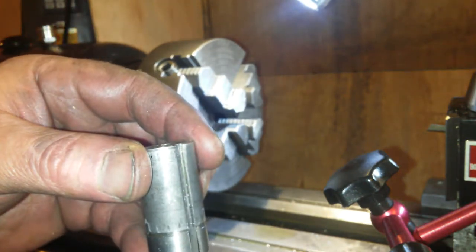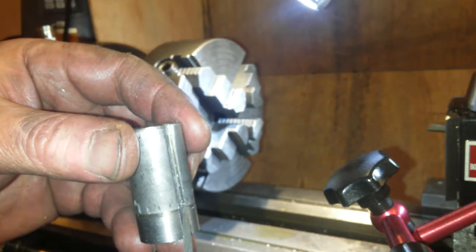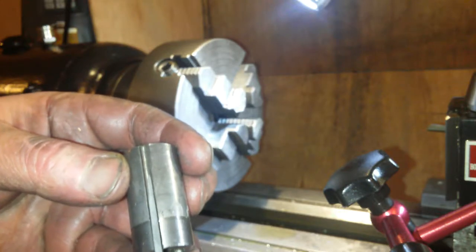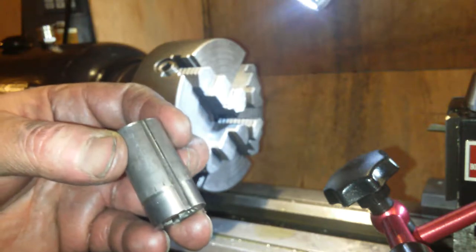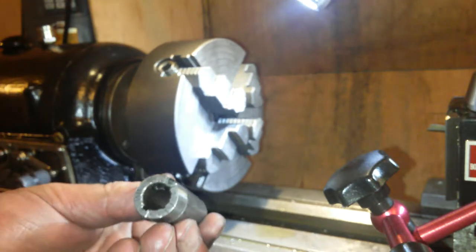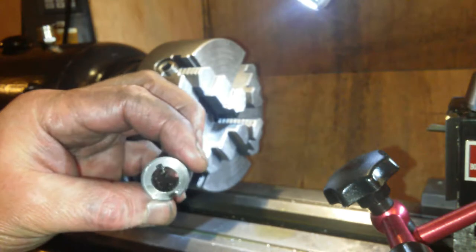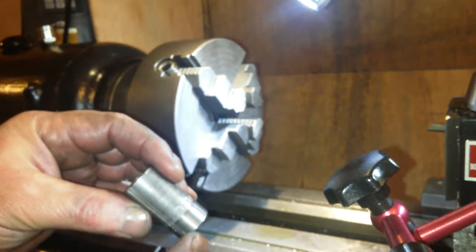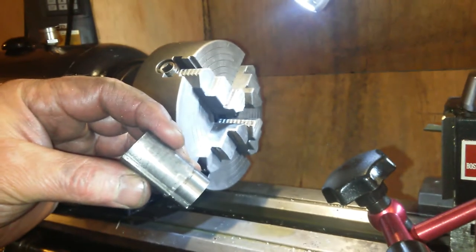So the file, right where the tip of the file is, there's like a line. And now I'm just going to go in with the file and do that. Well, I'm not doing it there. I will do it in a safer position. But that's extended the key, so now I've got a full half inch spindle with the key all the way down it. And these two diameters, I've turned this bit of diameter here, they are identical to the 10th.